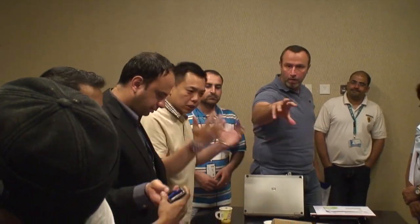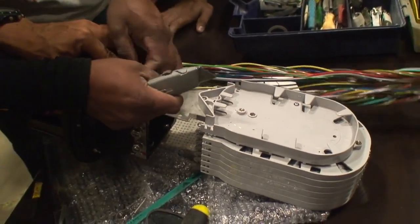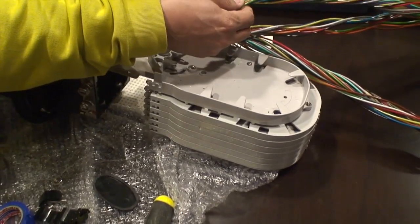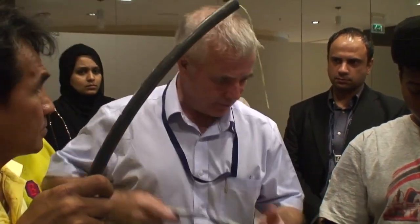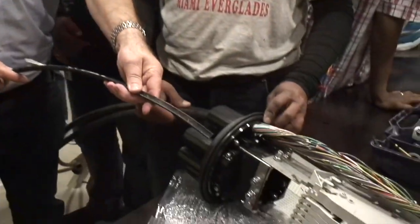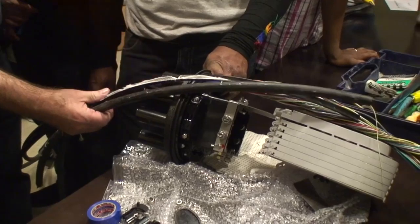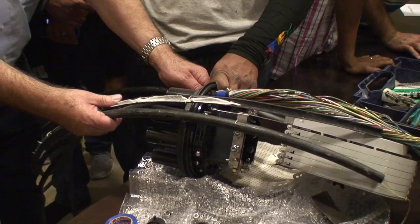How many trays do we have? How many fibers can we accommodate in these trays? Okay. We are talking about the size, all of it — the space inside. Here you can accommodate 12, 24, 48 maximum. Until there, more than this you cannot — you need space. At the back also, this size is only for bare fiber, not with tube. Correct. Even if it is 48. 288 fiber — we've got to go in again. There are ports here, no problem at all. We can come in. Then the next one in here. What I'm saying is, no offense to anyone — this is not suitable for anything over 48 fiber.